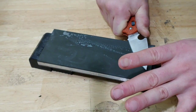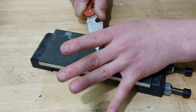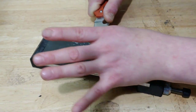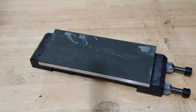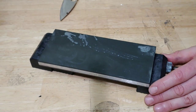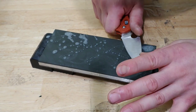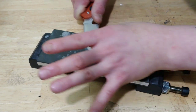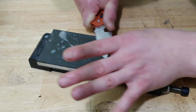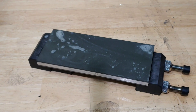As long as my angle stays the same I can move back and forth across. I'm going to want to lift a little bit when I get towards the tip — just to get the tip — or go around like that. You basically just rock your wrist just a little bit as you turn. I can definitely tell this thing is more aggressive than I thought it was going to be, but I guess that makes sense — this being one of the coarsest stones. This thing is going to have a screaming sharp edge when we're done.